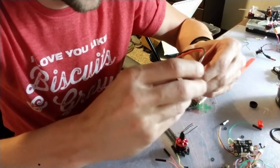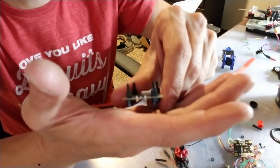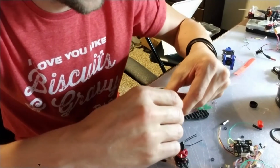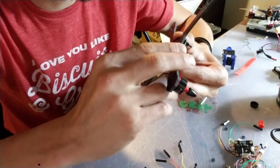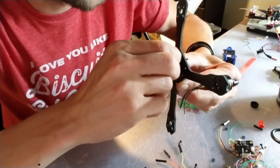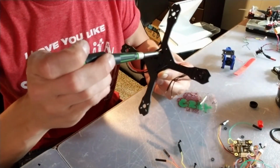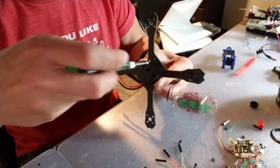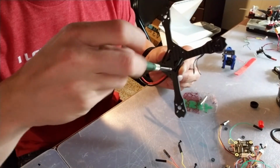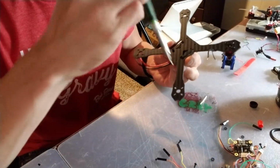Now I'm going to be getting ready to mount the ESC, and I've already kind of built the stack. You can see here, I just put the standoffs and stuff on it, so I've got that situated. So I'm going to go ahead and screw on these here. Where's my screwdriver? So I'll screw this on first, and then I'll get my motors installed, and then we'll get them all soldered up,